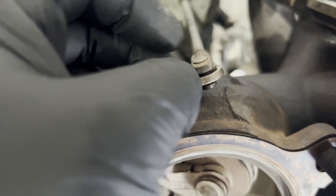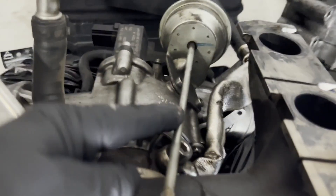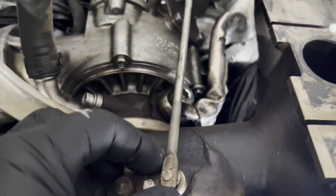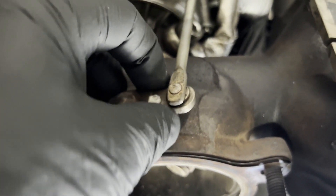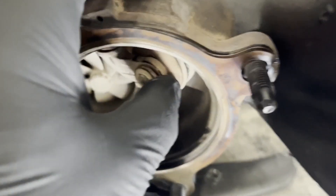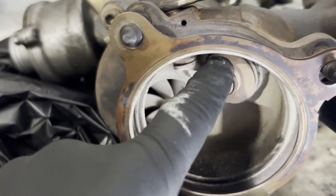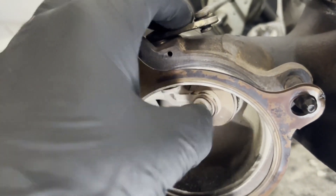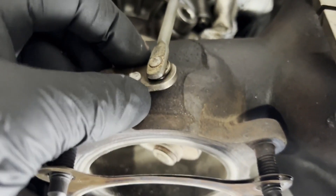If this thing is ruined, either you'll be adjusting these or pulling the rod back - it doesn't matter. You're not going to solve it. It's going to be delayed when the turbo comes to open the gate. You might have overboost, and you're going to start seeing popping in the hoses and all kinds of problems, and for sure it'll give you a check engine light. When this is ruined, it needs to be fixed here, not over there.